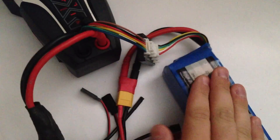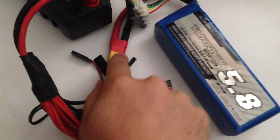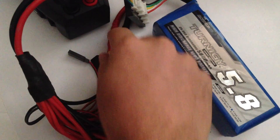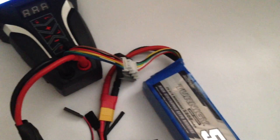To do this, I've got the battery plugged up here. You plug in the main battery port to this wiring lead, the one that corresponds. This is an XT60, so you go XT60 to XT60, and you plug in your balance port to this one right here.